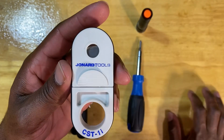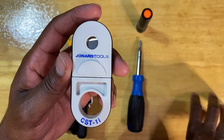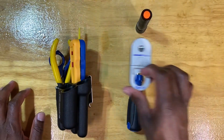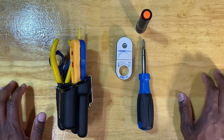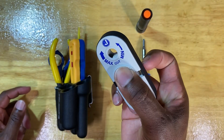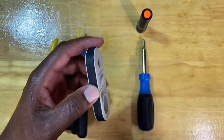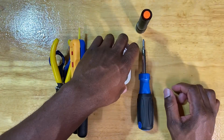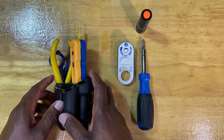Great stripper. It's rated for Cat 6A, but I have stripped Cat 7 shielded with it, so it works fantastic. Be careful with your shielding when you're stripping because you don't want to nick that either. You can make adjustments as you go. If you just want to score it, it works great. When using this, the more revolutions you make, the deeper you'll go. So you need to get a feel for how many revolutions you need around the diameter of the jacket to get your perfect strip.